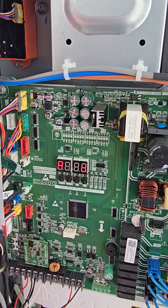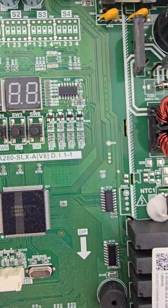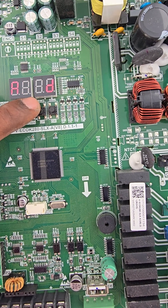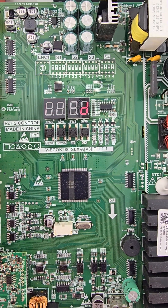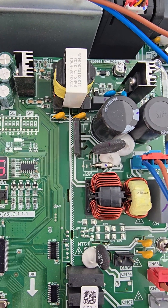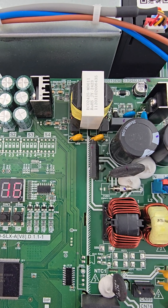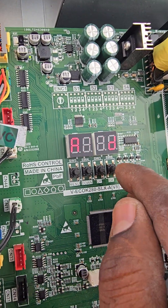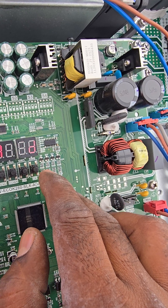It will take some time. AU AD is still flashing — it is reading the indoor units. After several minutes it shows zero-one-six and AU AD is still flashing. It shows zero-one-six because we set the indoor units to sixteen. We press OK again. It's still flashing.